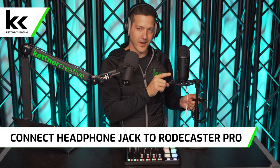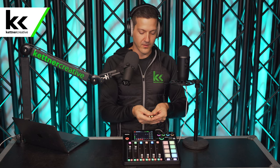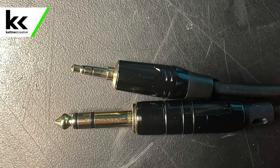You can see there's a red light on the USB microphone — it has power. That's step one. Step two is to take the headphone jack output of the USB microphone and get that into one of your inputs on your audio mixer. To do that we're going to use a cable like this — a balanced eighth-inch TRS to a quarter-inch TRS. It is a balanced cable, but the way we're using it is unbalanced because we're taking an unbalanced stereo signal — left and right outputs of the headphone jack — and bringing that into the Rode Rodecaster.